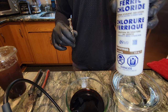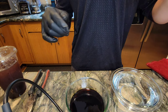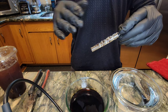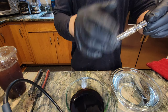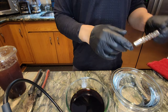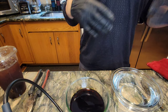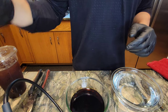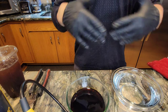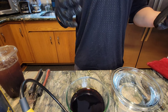What we're going to use instead is ferric chloride. This is a copper etching agent, but if you stick your hot titanium product into it, it will cause lightning effects. If you go in really fast, it causes streaks; if you go in slow and quench it nice and slowly, you get waves of white lines and colors. Today we're going to go fast and attempt to get that lightning look. The only other products you need are distilled water to quench your product, and MAPP gas — the yellow canister — which allows your titanium to heat up to the right temperature to be anodized. We're going for some blues, purples, and greens.